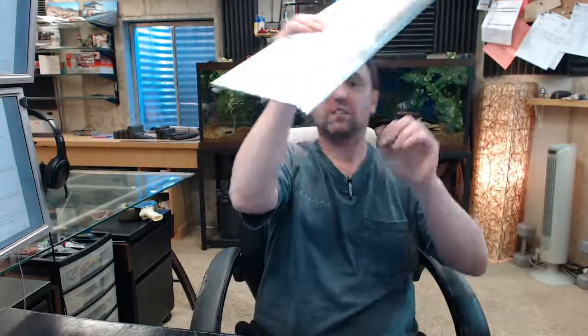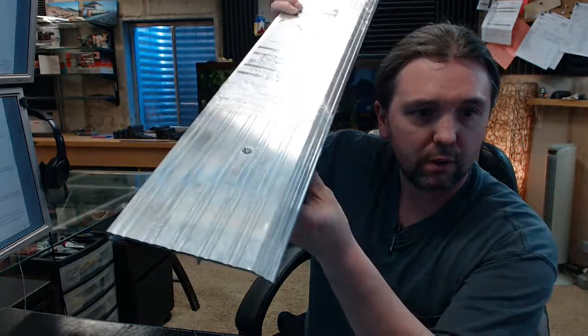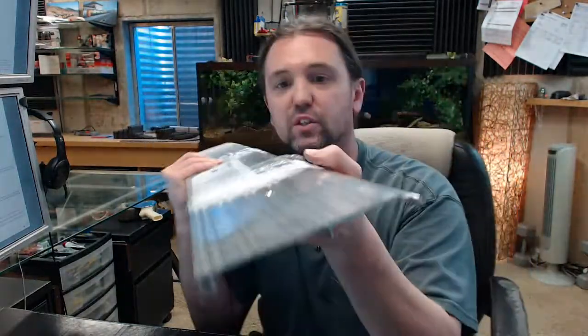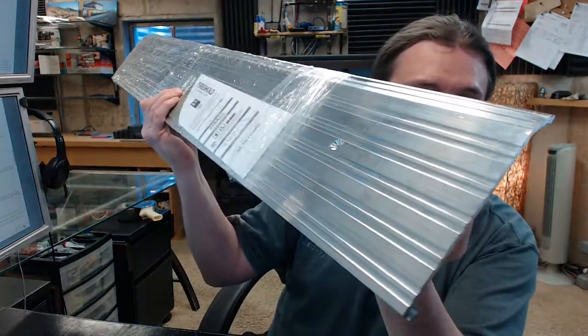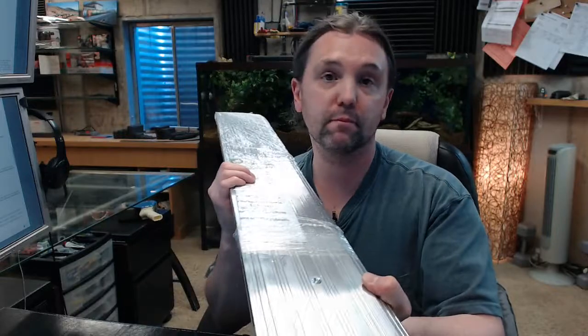Hello, my name is Rich Howard, owner of Architectural Builder Supply, and this video is to bring you a closer look at the Pemko number 256A. This is a half saddle threshold. The 256 is representative of this profile, meaning it is a butt up or half saddle threshold with these specific dimensions which we will go over in a moment. The A stands for aluminum finish. This is also available in the D Dark Bronze and the G Gold anodized finish.